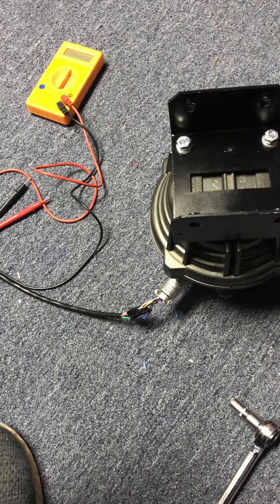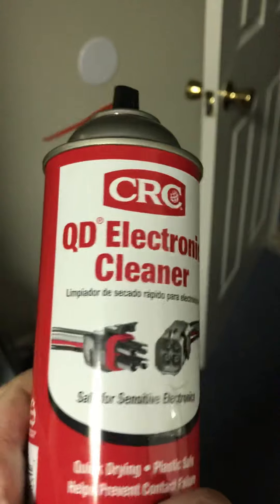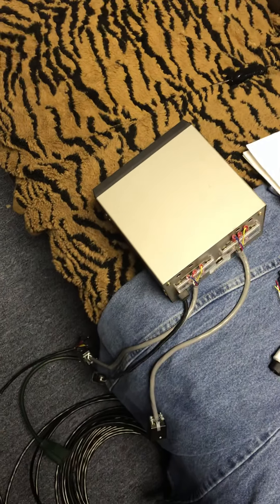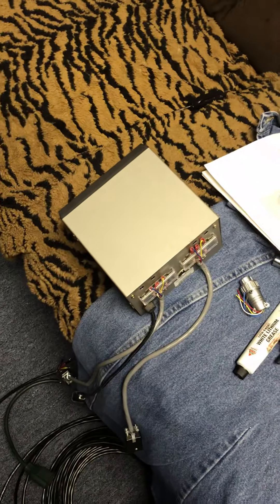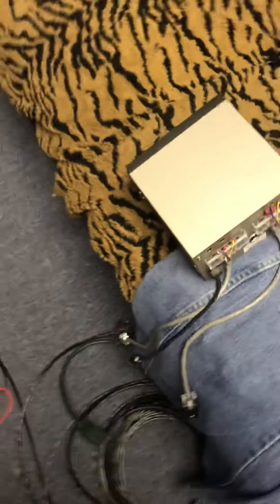So that's a good way to calibrate your potentiometer — clean it, try to clean it good, and just roll with it. The cleaner I use is CRC QD Electronic Cleaner — it's about six bucks for 11 ounces. I pretty much doused the pot in it, let it dry, and wiped the outside part off. So it's close but no cigar, but at least it's working — ballpark. Hopefully the rest can be finished on the back panel full scale adjustment. Thanks for watching, guys.